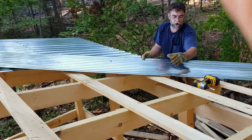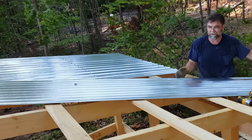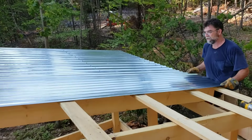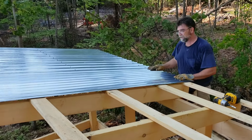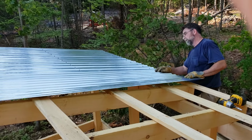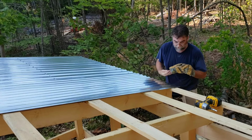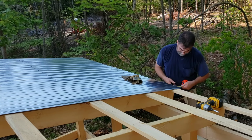It's not heavy at all. I think they may weigh about 8 or 10 pounds a piece. Because this is a roof overlapping 2 channels, not just one, I'm going to make sure it's overlapped on both sides. Okay. I'm still making sure I'm an inch from the rafters.